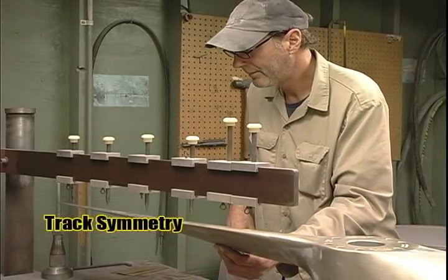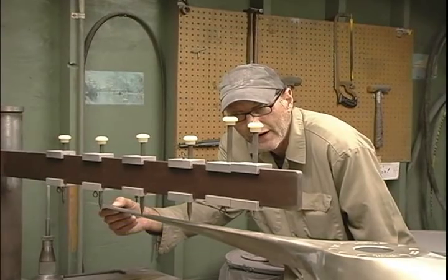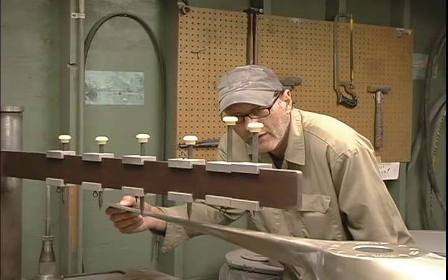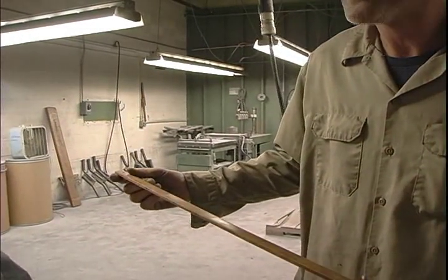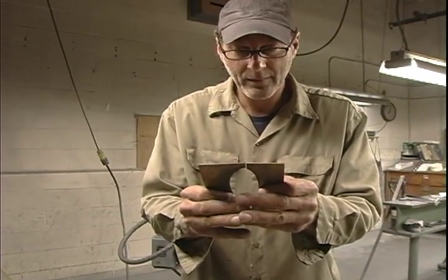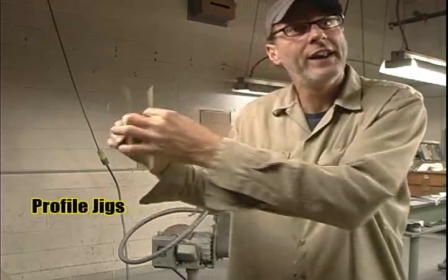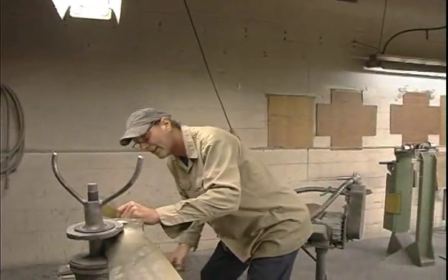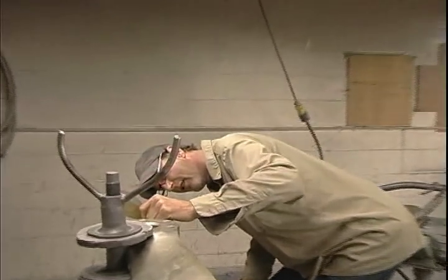You do that on each of the marks. I'm bringing it in and it lines right up — it doesn't scrape or anything, it's perfect. This table has all the Sensenich props with all the station lines marked out on it. It's probably sixty years old and it still perfectly lines right up. This is a profile — a cross section — this is the first station, and so on down the blade. What I do first is check fit. Generally they're pretty close. I mark where it's high.